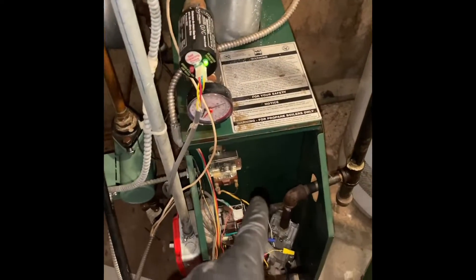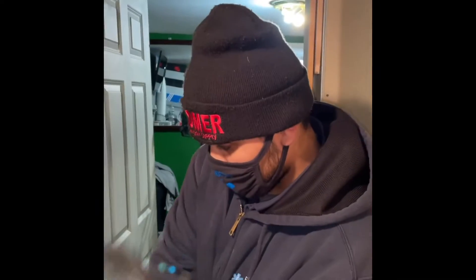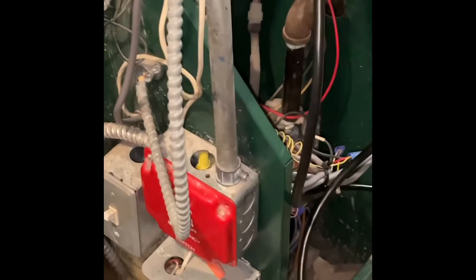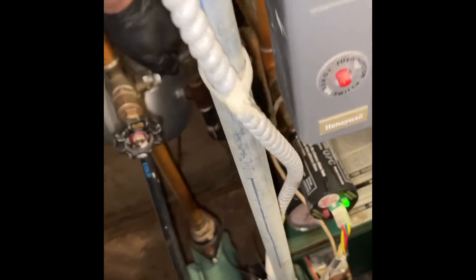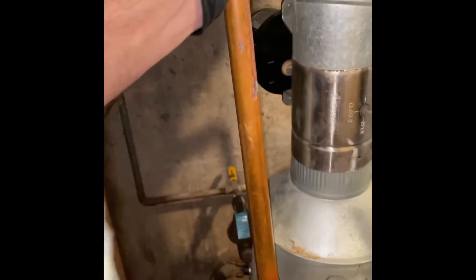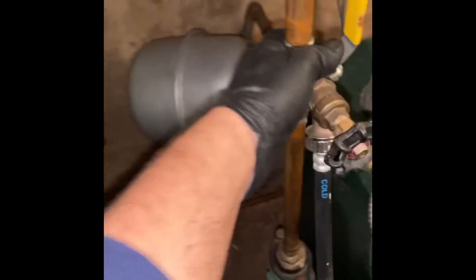I do the one on the left, Kelvin's working on the one on the right still. I want him to adjust the gas valve down there - levels weren't right. This boiler over here, it's hot leaving, just cold still coming back. So we're going to purge this out - I got the purge station right here. I'm going to close this valve, open this valve up right here, get the hot water through this boiler, open up the fast fill.